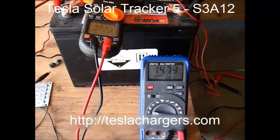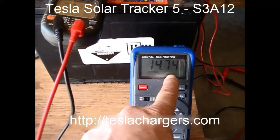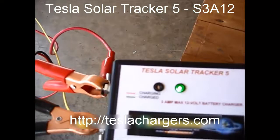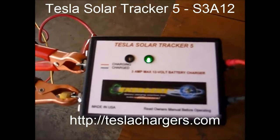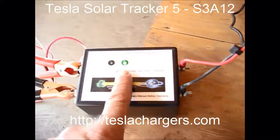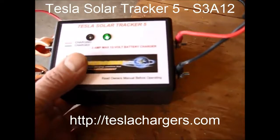I'm back. The meter is right now at 14.74 volts, and the current is at 2.24 amps with the little 3-amp charger. The green light's on now, indicating it's going to float up to 15 volts — it's only going to produce a micro-boil in the battery. The battery is cold, and you can see the light comes on at about 14.8 volts, telling you the battery is pretty well charged. No heat in the unit — pretty much cold.